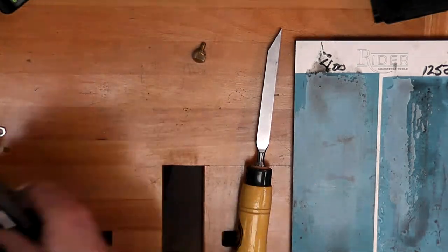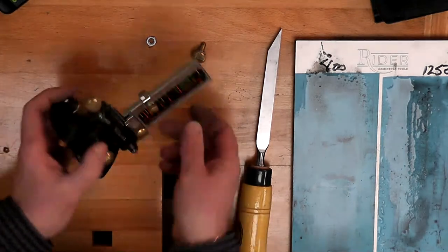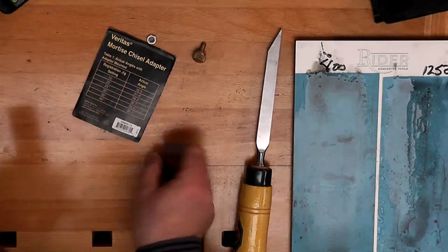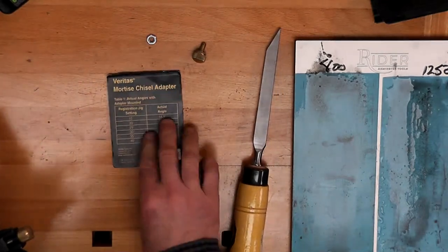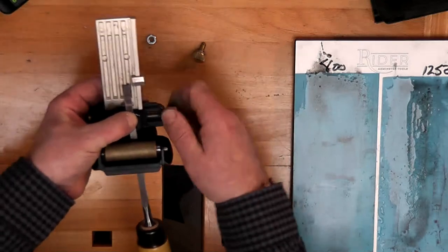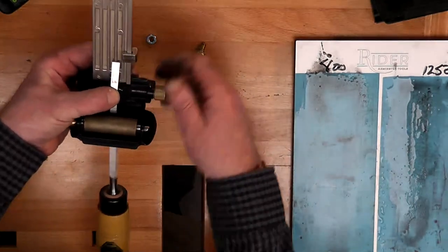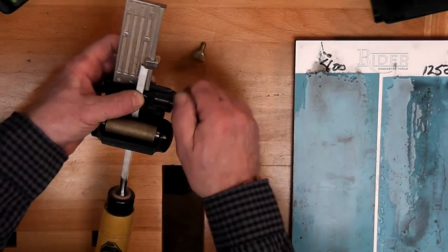With the normal one for the hand plane, there would be three. The setup jig, we can use exactly the same. I want 30. It doesn't change anything on here. But there is a reference chart if you get stuck on different angles. Okay. Because you've moved it up higher, that can affect it. I can get my mortise chisel into here. First of all, it clears that roller now. I can feel it does just from what I'm doing. Lump stop coming through up to there.